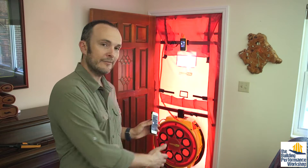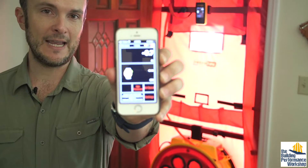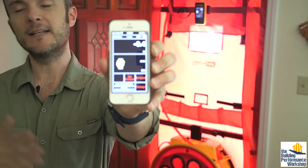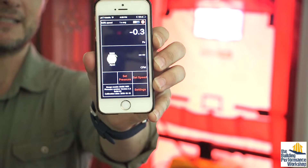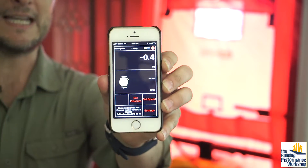Now we kick on the most important tool. The blower door is set up with covers in place. All doors and windows are also closed outside, and we're running at a baseline pressure on channel A of roughly zero. Each pascal in layman's terms is basically the weight of a Post-it note. We're already at zero because the wind is not very strong and we have a short house, so we don't need to run a baseline. That saves five or ten seconds.